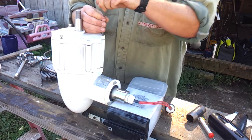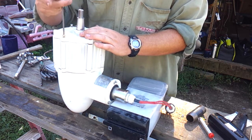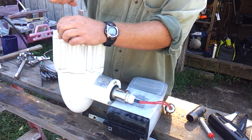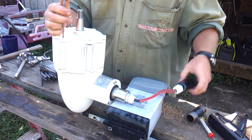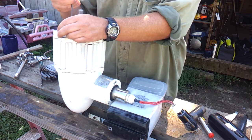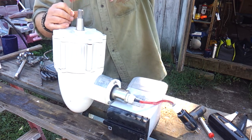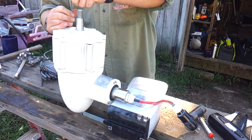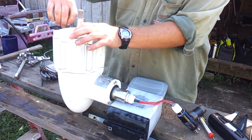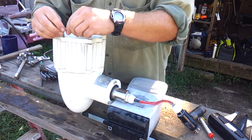Right now everything is 12 volt, but this is a 24 volt generator. I also received along with this a 24 volt hybrid charge controller designed to take the three-phase AC directly and turn it into 24 volt usable DC, and it can also withstand 300 watts of solar. So what I have to do now is completely convert my 12 volt system to a 24 volt system — which I knew I was going to have to do at some point.